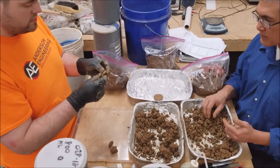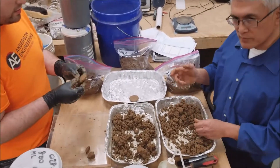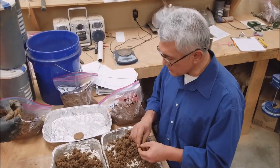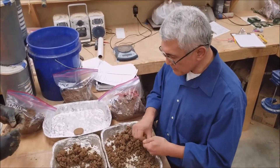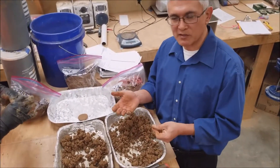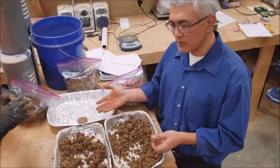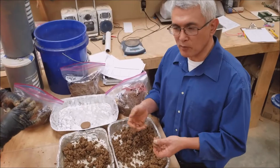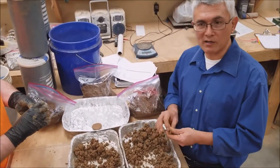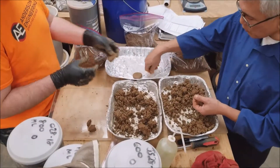Just fixing a couple holes. So while he's doing that — this is called the breaking or crushing strength test; we call it the cookie test. As part of that test, you'd break your cookie after it dried out. Depending on how much effort: a fat clay you wouldn't be able to break, a lean clay you'll break with a distinct amount of effort, and if it's a silt it'll break more like a dry cookie. As part of that, you'd break a little smaller piece off and try to crush it.